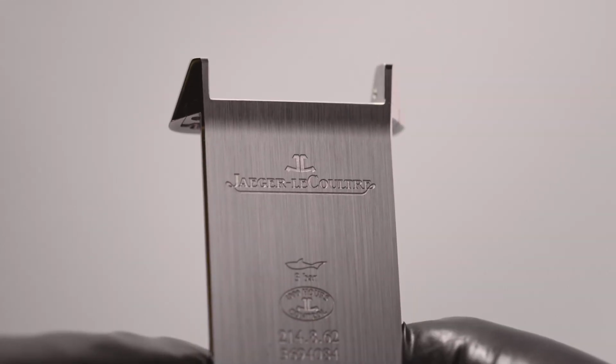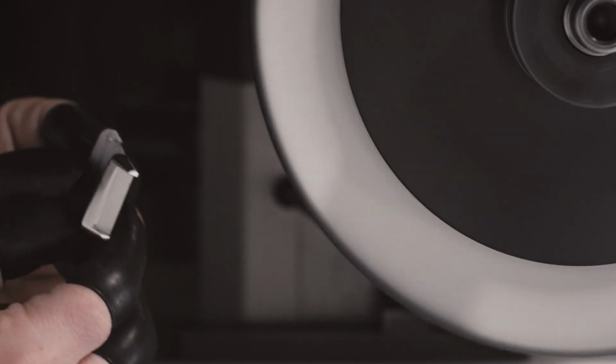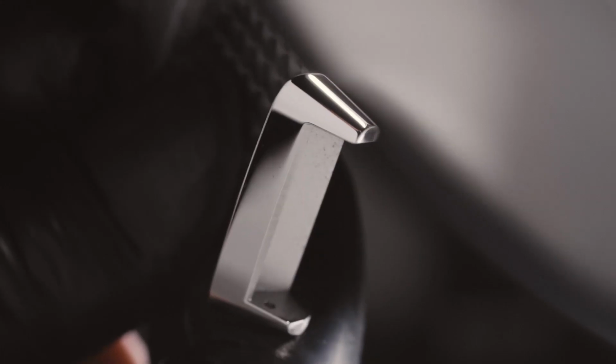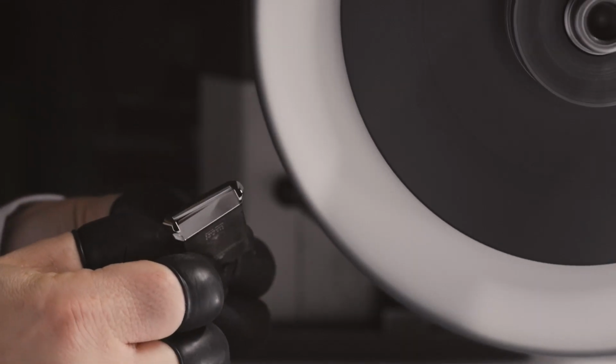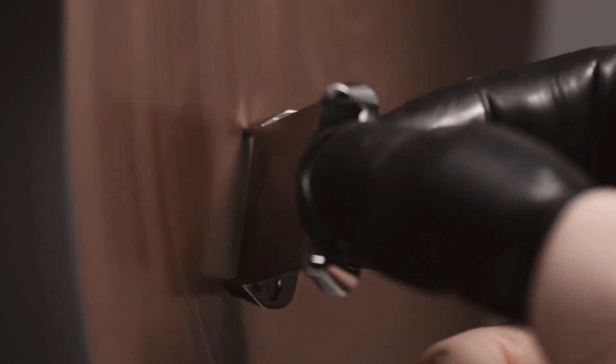But the most difficult part are the pieces with different finishes side by side, such as polish here combined with satin or microblasted. For this type of finishing, there are no secrets. Everything must be done by hand. Then comes the brightening stage, a very light polishing. It is the last touch to obtain a mirror polish. And we finish by redoing the edges by hand. These passages are done without holders, just our fingers and our feeling.